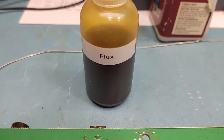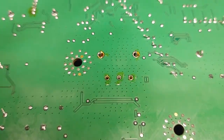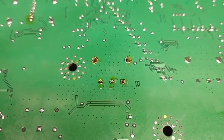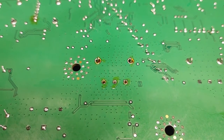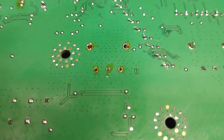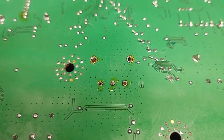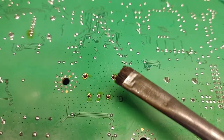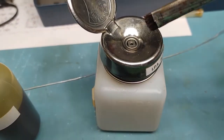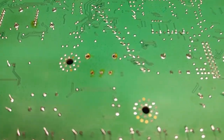A little top tip here: I always use a liquid flux, especially when I'm soldering on multi-sided boards. You can see it installed right there — just a little dab will do you. That just makes the solder adhere better because the acid in the flux cleans all the soldering surfaces and makes sure you get good adherence. It'll make the connection last longer and look cleaner. This is not a water-soluble type of solder — this is the old school stuff that's kind of like tree sap. You need a little acid brush with the hairs cut off, and some alcohol to clean off the board. It gives you professional results.